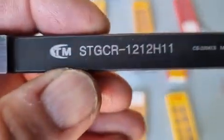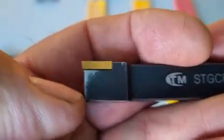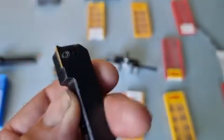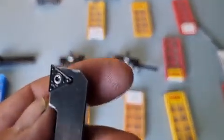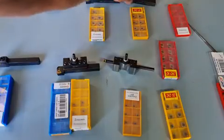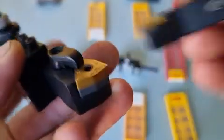When I first started using carbide bits, I bought this particular piece — you can see it's got an angle there — and you can only use it once, so you get to use it three times total. The thing I dislike about these is they're okay for general turning, but if you've got a weld on a piece of metal and need to turn it down, I've chipped these so many times. They really can't handle a lot of punishment like the trigon or the triangular type. Look at the difference in thickness — this is twice as thick.